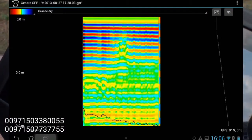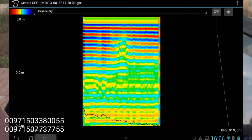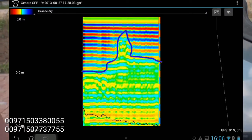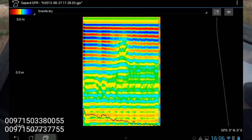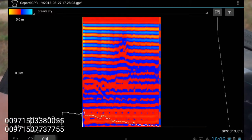As I look at the data here, I know that I traveled over this pipe. I can see in the scan that the anomaly is a plastic pipe — it has no actual signature. As we can see in the data, you can see it here. But sometimes if you change the color, you can see the anomaly more clearly.